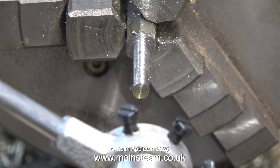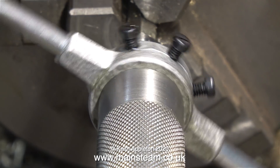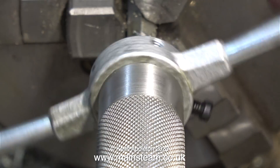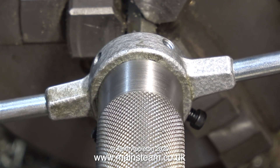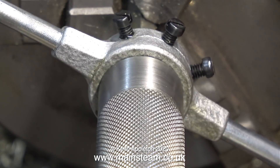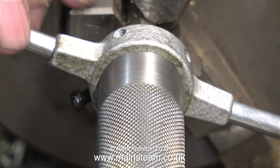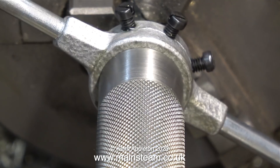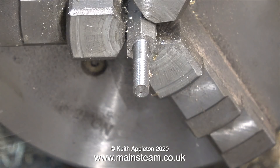Once I finally reached the right size, it was time to use my own specially made tailstock die holder, which allows me to preload dies into standard die holders and just fit them on this adapter. This is far quicker than fitting a die every time into a proper tailstock die holder, and at about £35 each it would be very expensive to fit all my dies into commercial holders. How do I know how deep to cut the thread? Here's a good tip: I cut the first thread on the first bolt and get it to be exactly the right length. Then I rerun the die down the bolt, counting the revolutions, which worked out to be 29 revolutions for the length of thread I needed. Here's the finished thread on the first bolt.